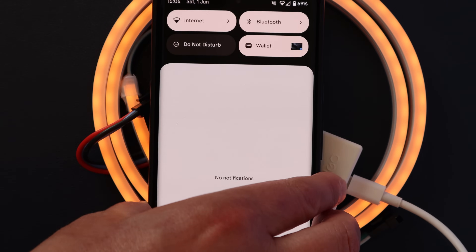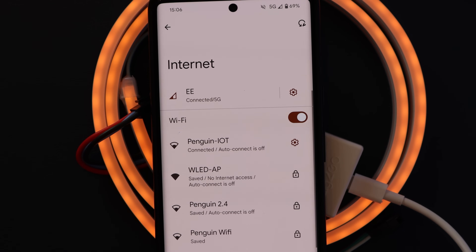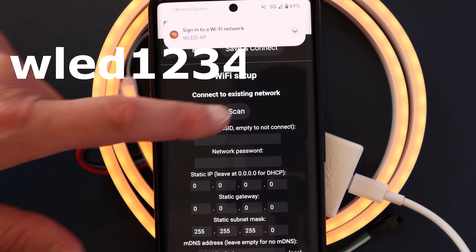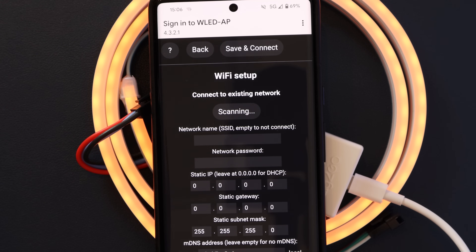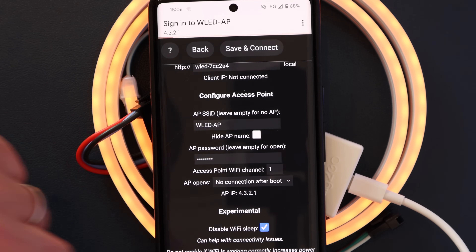Setting them up is also very similar. Once you've connected your LED strips and plugged them into the power, it will start broadcasting the WLED Wi-Fi connection. You can then connect to this Wi-Fi network using the default password, which is WLED1234, or lowercase. Once you're connected, it should take you to the configuration page. If it doesn't, just open a web browser and navigate to the IP address 4.3.2.1. Here you can enter your home Wi-Fi details, and set up LED strip preferences such as the type of strip and number of LEDs. For more information, check out the WLED documentation or my previous beginner's guide video, both linked in the description below.